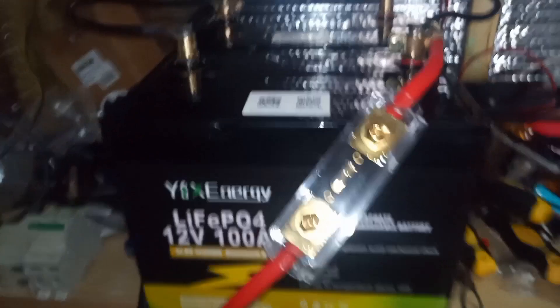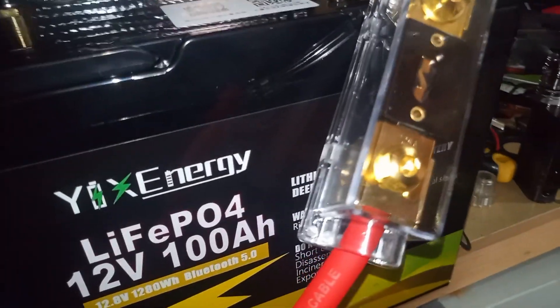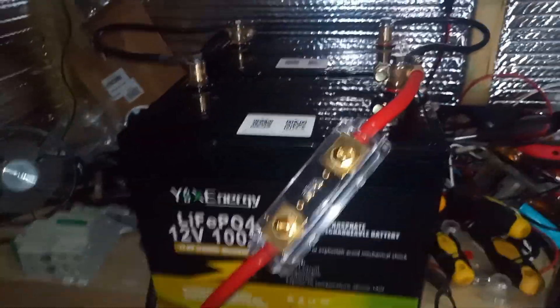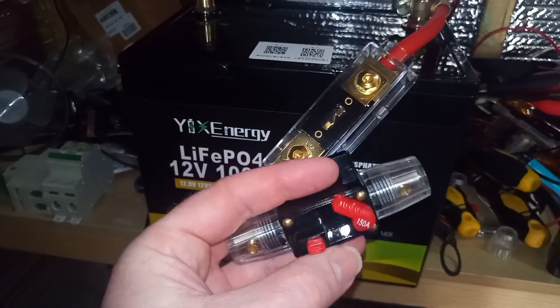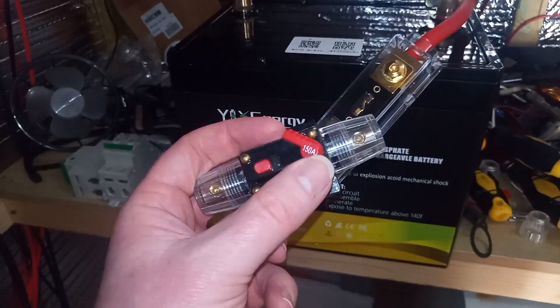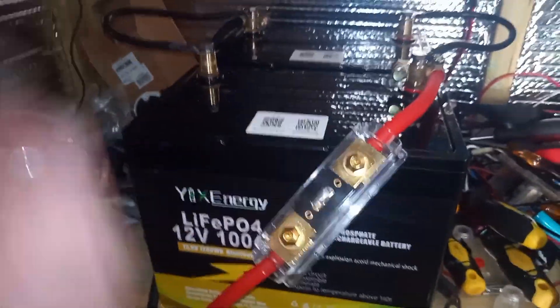That's my little update. Basically everything's the same but I've got this new big breaker - it's the ANL fuse, one up from a mega fuse. The hierarchy goes: blade fuse at the bottom, then glass fuse, blade fuse, they all go up, then mega fuse, then this ANL fuse. I was using a mega fuse beforehand but I don't like them because I had one that just overheated - it didn't actually trip. When I tried to trip it manually, the plastic had heated up so much it wouldn't trip. That was a 60 or 25 amp one, so we're not using those anymore. I've got the spare ANL fuses as backup. That's my update - thanks for watching, catch you on the flip side.